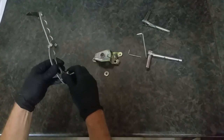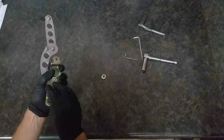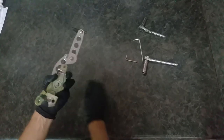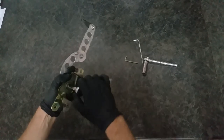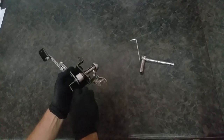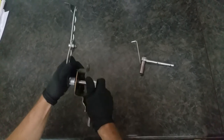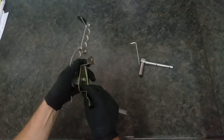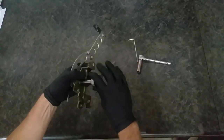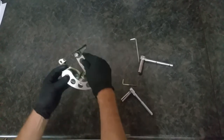This is how you will set drag on this piece. Once that piece is assembled, put this piece onto here, centered on the shoulder, this washer on, this nut. Tighten this down. If it's too loose, screw this down against the lever assembly. Center this back up and tighten this down. That's how you assemble it.